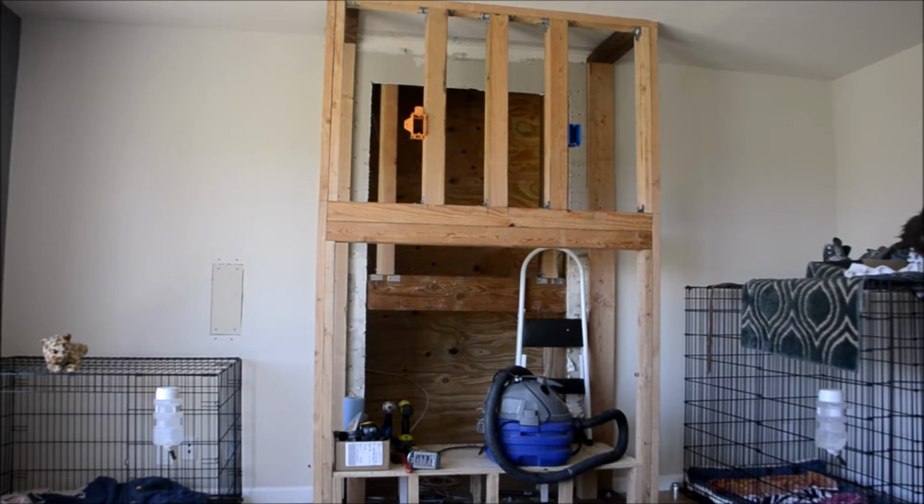Alright, so here's the frame for the ML47 heater from Mendota that I'm going to be putting in. As you can see, I built it out of 2x4 and 4x4. I put the 3 vertical beams up there so I have something to screw the television enclosure into, and double stack the 4x4s just in case I want to have a mantle there to deflect some of the heat if it becomes a problem.